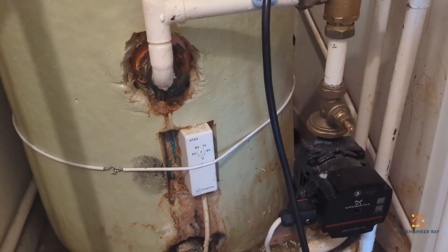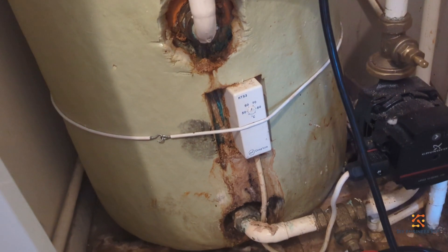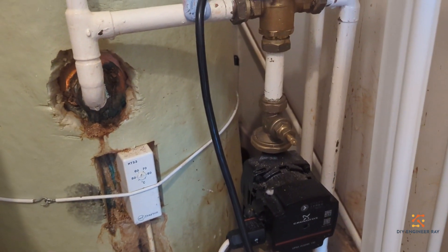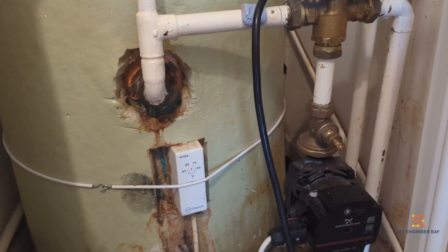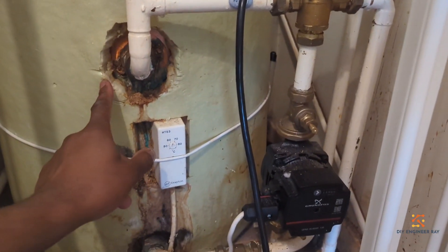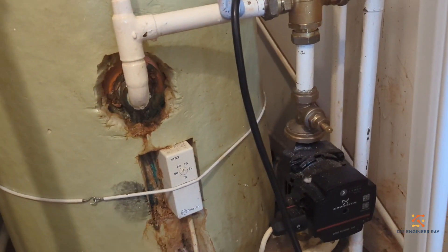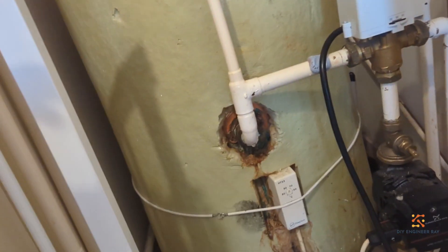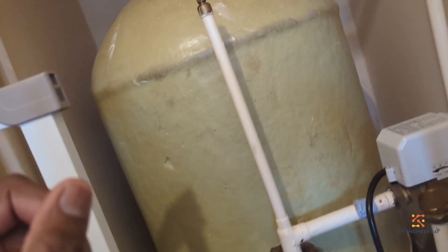The cylinder itself acts as a heat exchanger. Cold water gets in from the bottom and hot water gets out from the top. There are also two separate loops of water here which don't mix. One loop is on the open side of the cylinder; the other loop is within coils inside the cylinder. The water forced through those coils circulates via the pipework on the right-hand side, whereas the left-hand side was for cold water inlet and hot water outlets to the taps throughout the house.